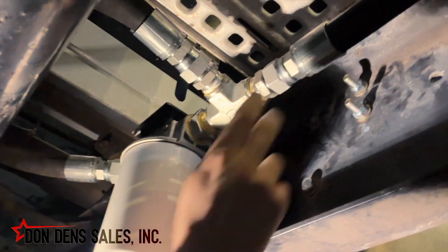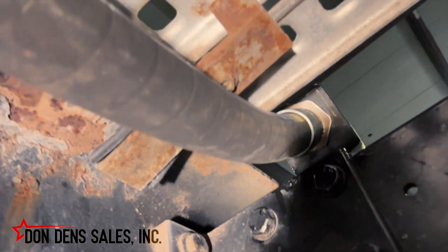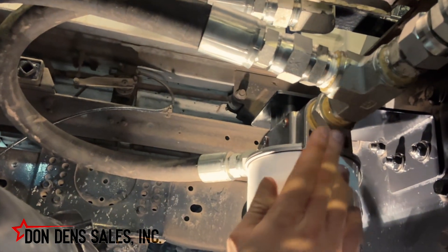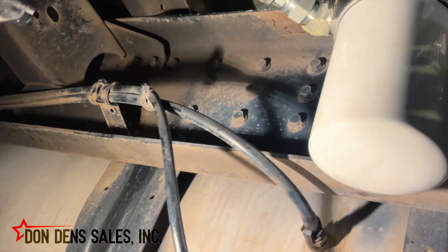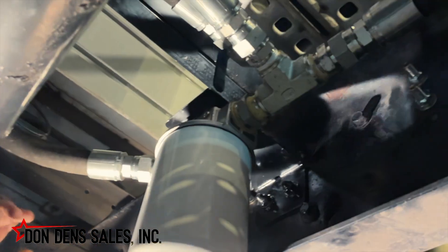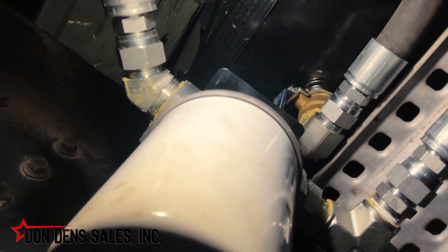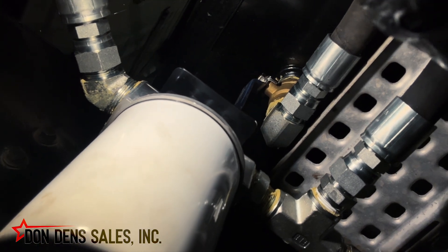The return line is coming from the trailer — that's the second bulkhead fitting from the walking floor trailer. That T is your return back to the tank. From the pressure relief it's going to come into the return line back through a filter. If you're running any sort of hydraulic system or PTO pump application, make sure you install a filter in line to keep contaminants out of your pump and hydraulic system. That filtered fluid then circulates back up to your tank on the return side, which again has a ball valve on it so you can stop hydraulic fluid flow if you need to fix a leak.